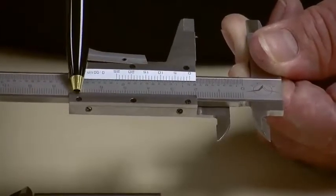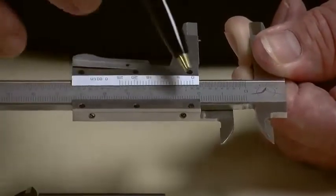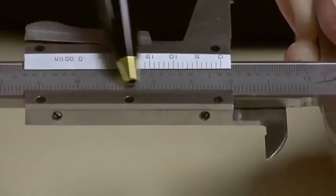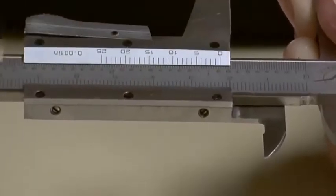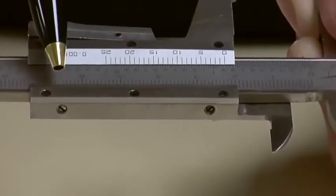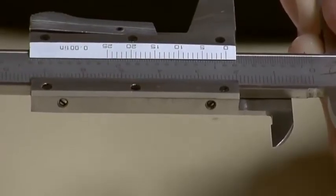In this one here with the 50-division mark, the vernier scale divides each millimeter of the main scale into 50 parts. So in other words, multiples of 0.02 millimeters or 0.002 centimeters.